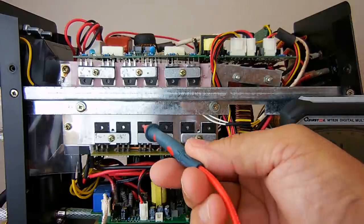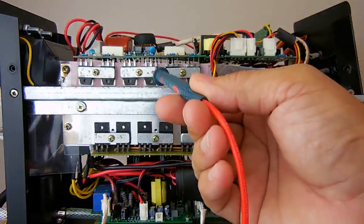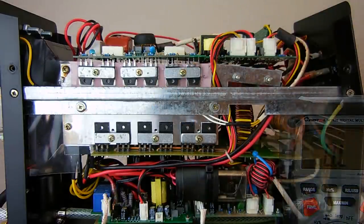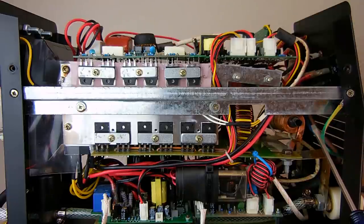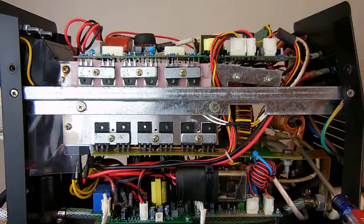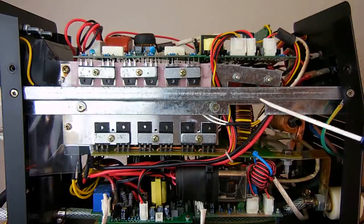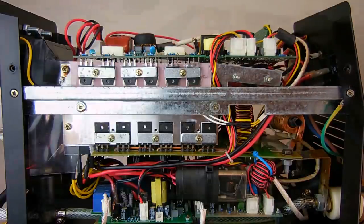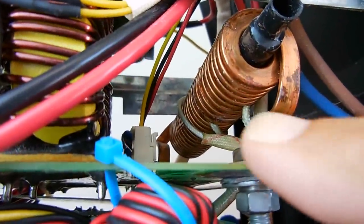You can also look at the MOSFET just like the diodes below — if it's faulty usually you're going to see a crack or a chunk blown out. There's a pretty cool inductor that runs right across the front here, apparently in series with the output of the plasma cutter. You have these two toroidal inductors, and up on top there are two large wire-wound resistors. Let me see if I can get a shot looking up to show a closer look at that inductor as well as the two toroids.